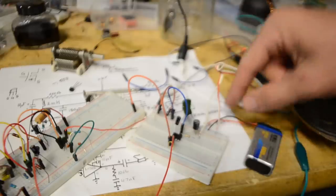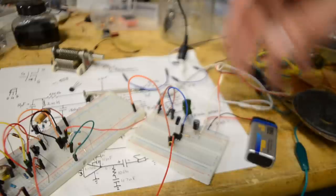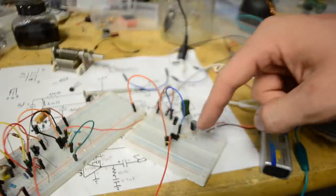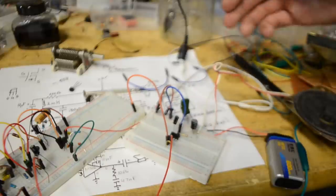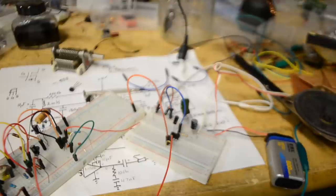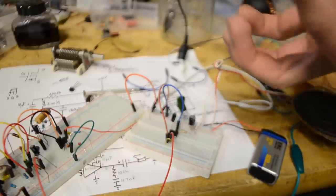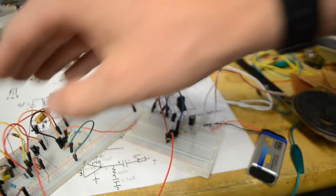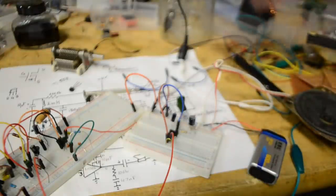I now have it connected up to the amplifier. I did have to supply a secondary source of power because running it off a common power supply was giving weird feedback that wasn't being affected by my hand position to the antenna. But with it running off a separate battery with the audio in — and not even a common ground — that's what causes it to work well. You can hear my hand is changing the frequency. Keep in mind you'll need two 9-volt batteries, one to power each circuit, completely separated from one another. I have this running at 9 volts, which works best with this circuit.